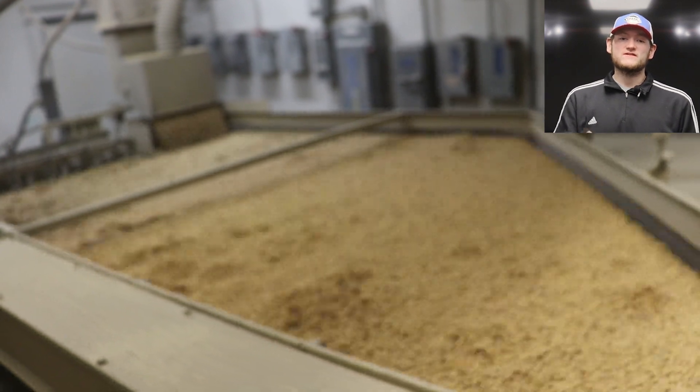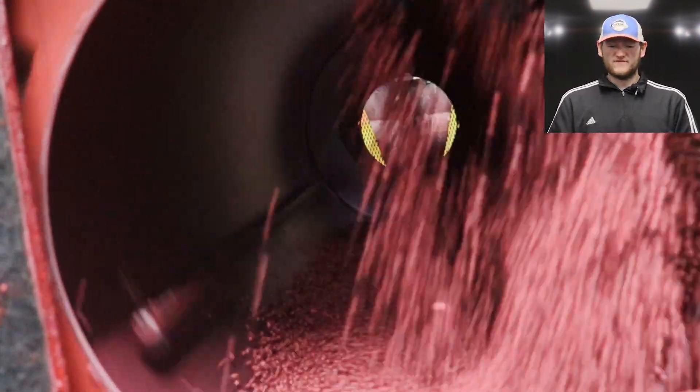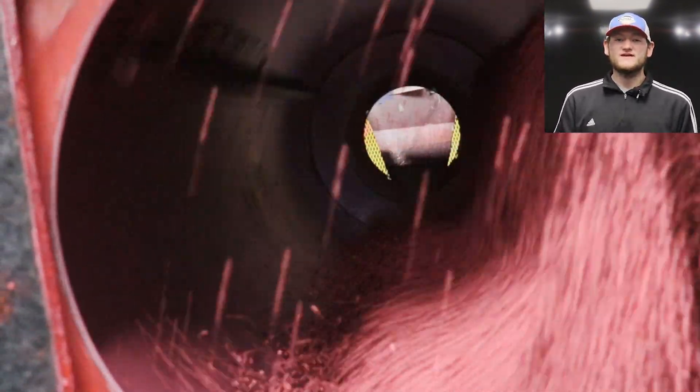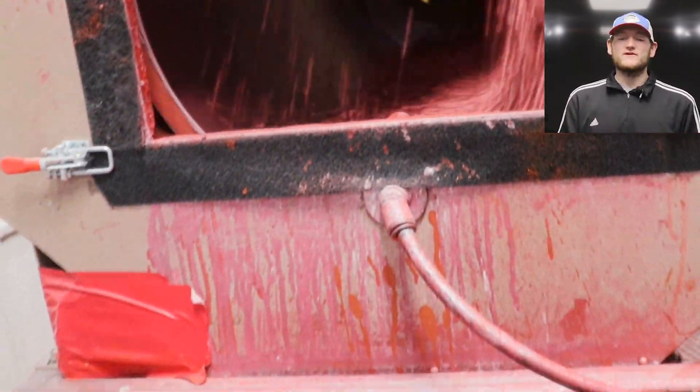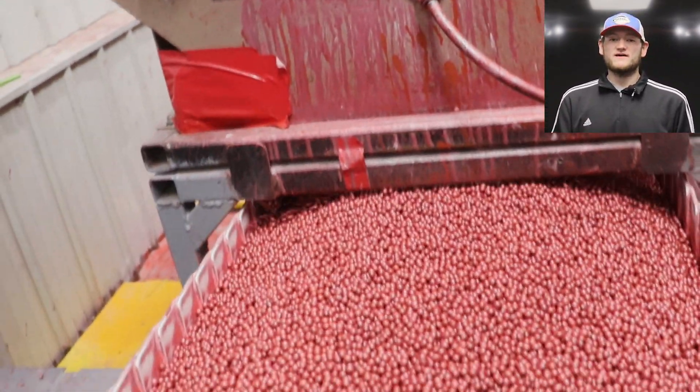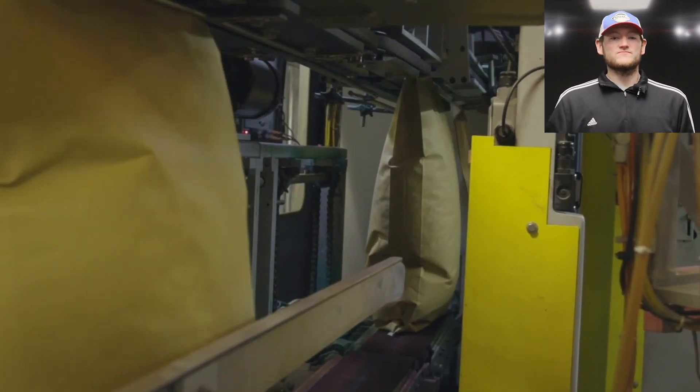The beans that make it through are put into a hopper and they're ready to be treated. We go upstairs to our continuous feed treater — it's continuously rotating, taking in soybeans, constantly treating them, and feeding them out on this conveyor. The beans you see coming out are fully treated; they are just drying and getting ready to go down to our bagging line.